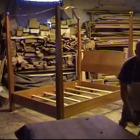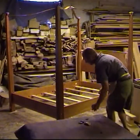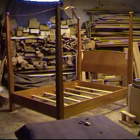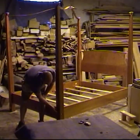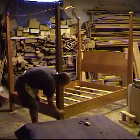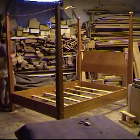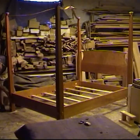The last piece of the puzzle, and some say the nicest, are these little caps that cover up the bolts. They have a very small little dowel on the top. If you saw the little holes above these bigger holes, all you have to do is just stick that in, a little bit of a bang, just kind of wiggle it and push it, and then just slide it right down into place. Do that all the way around. There are 8 of these, enough to cover all the holes, even the ones behind the headboard against the back of the bed.